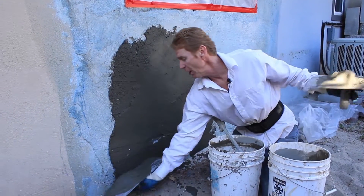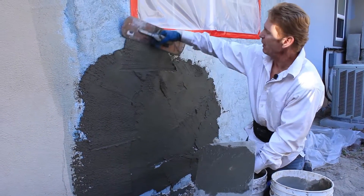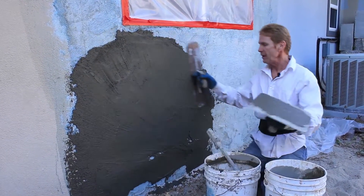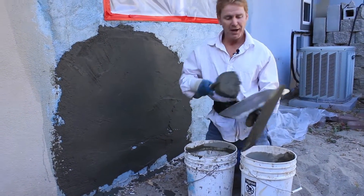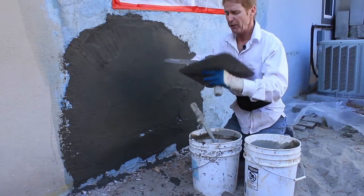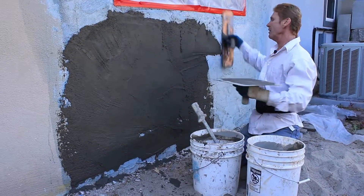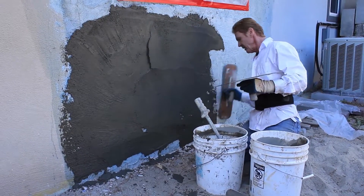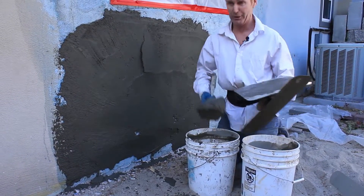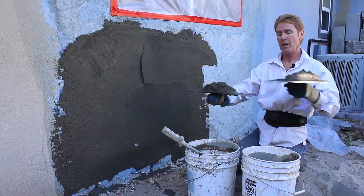Premium is a mixture of plastic and common cement. At the material yard, common is in red bags and plastic is usually in orange bags. You might have also noticed I'm using a huge trowel. This is just the trowel I prefer — it's a 20 by 5. I don't recommend anybody use a trowel like this, but it's not really the trowel; it's your skill. If you're going to use a trowel, get a 16 by 5. A 12 by 5 is standard issue if you're union.